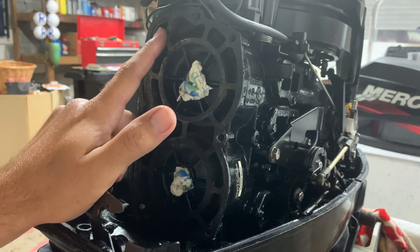That meant I had to drill them out, but I still had the cover plate on, held by five other bolts. I tried for about a day to get that one out with the cover plate on because I knew if those were such a pain, the others might be too. Eventually I decided I needed to get the cover plate off to access them better without tearing up the threads or the head more. I got three of the cover plate bolts out, but ended up breaking off two more — one I just got out yesterday.